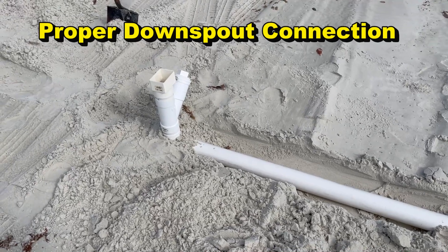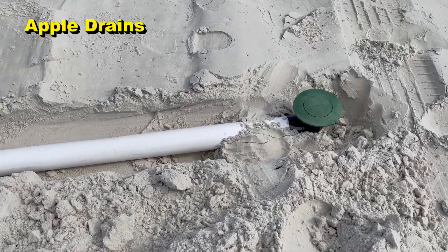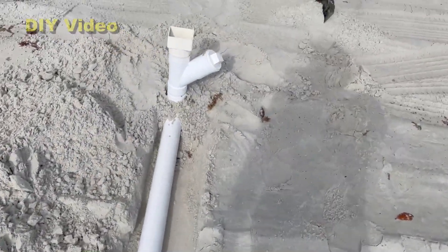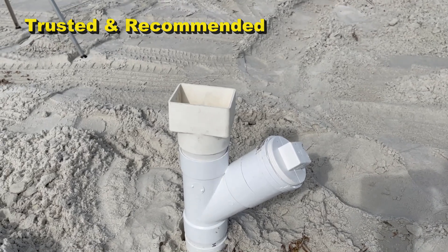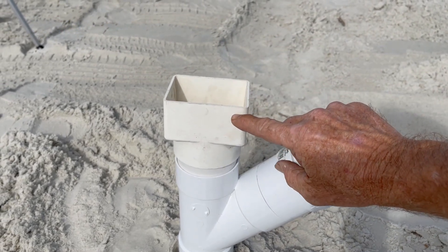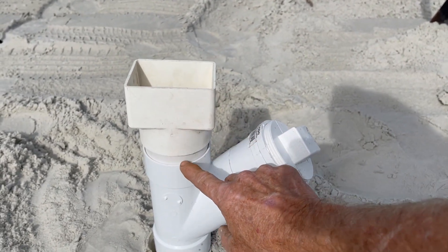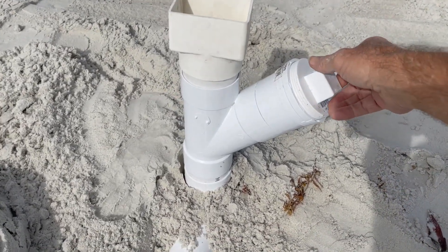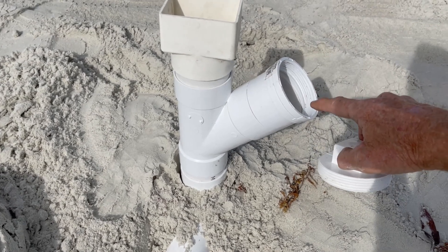Let's take a look at proper downspout configuration and the discharge. You can see I've just buried a little pipe with a pop-up right at the end. If you're going to hook up the downspout coming from the gutter, it would go into the square fitting — this is a downspout adapter, this one's 2x3, so it fits the 2x3 downspout. You can see it goes square to round. Although you don't need to add a cleanout, it's recommended. We've got a cap and another fitting — you can see it'll screw right in there. This will allow you access to clean the line in the future.